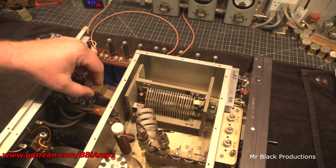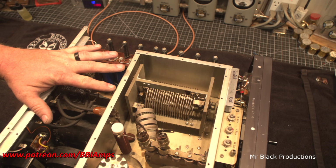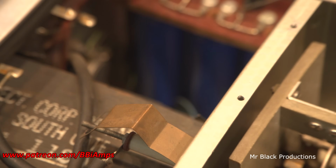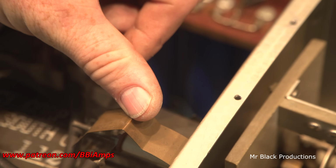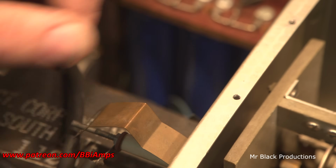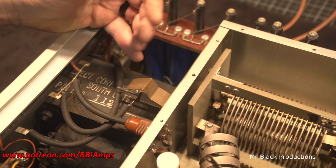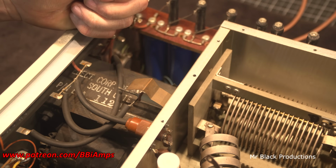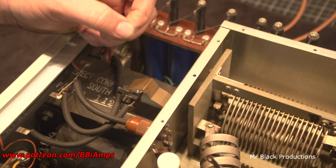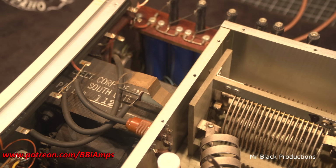Our safety interlock is now officially bypassed. This is our high voltage interlock. And the whole idea is when the lid's on it, this little pressure ring here floats and doesn't make contact. When we take the top off, it shorts out against ground. This is your high voltage lead. You guys that have seen these before, you're familiar with this technology. It's elegant, simple, easy. Otherwise, KISS. Keep it simple, stupid. We're going to bypass that for a minute. Just straight up bypass it.